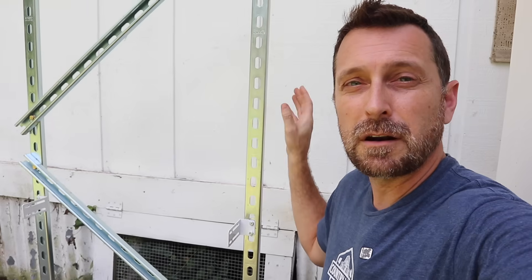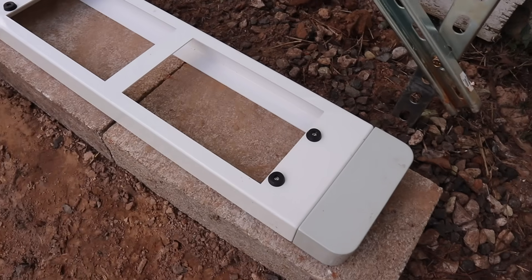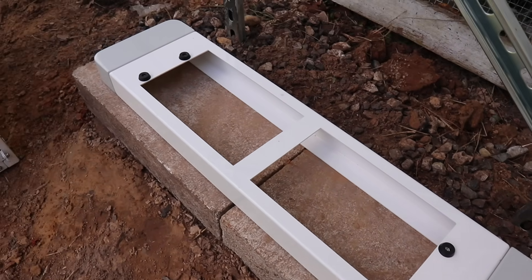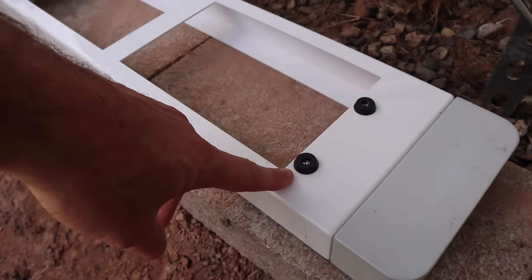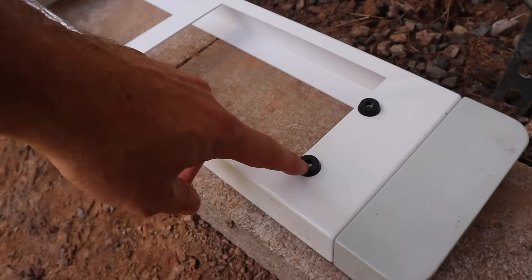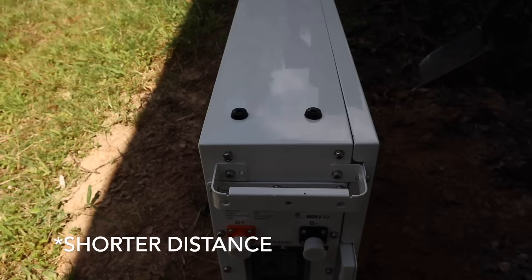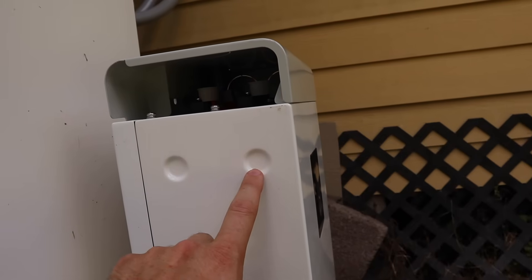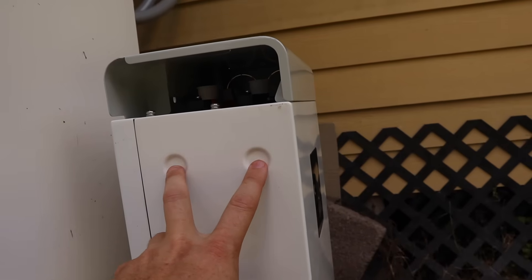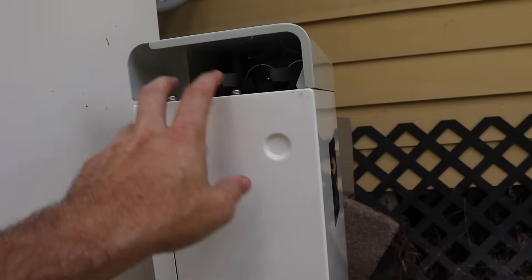You need a dead flat surface on the exterior — brick is one option, but you can also do something like we're doing here: Unistrut buried two feet in the ground in concrete and braced. If you buy one of the kits, set the base down on a level flat surface with the rubber washers with the shorter diameter toward the front. The rubber stoppers sit in the indentations on the battery bottom and control box to prevent sliding.